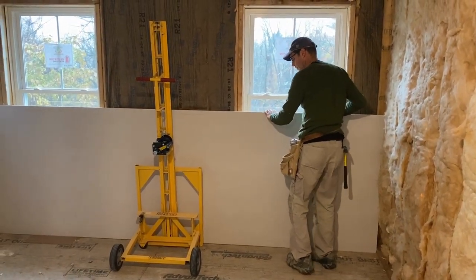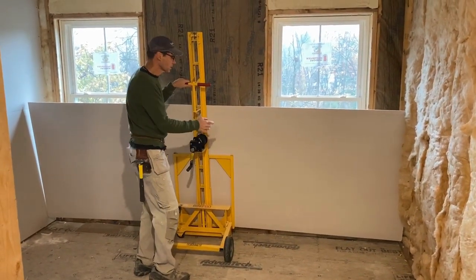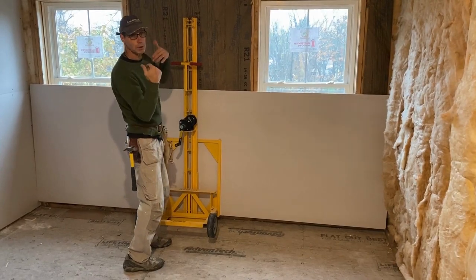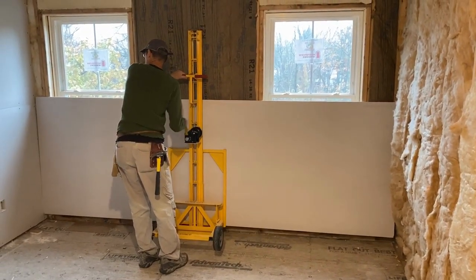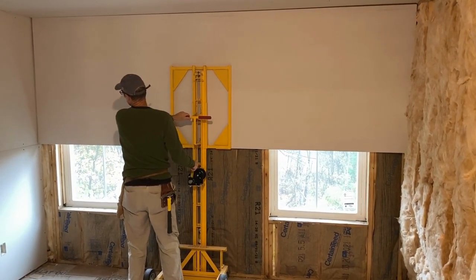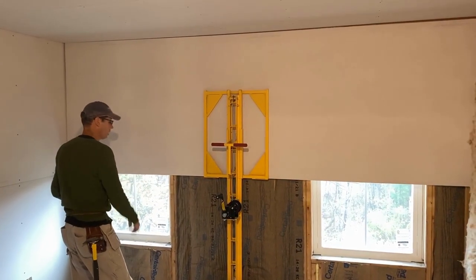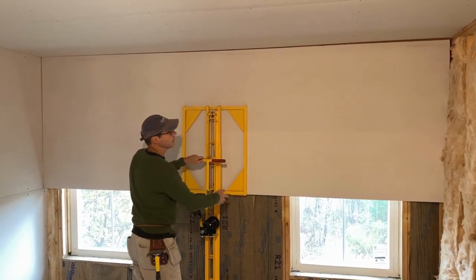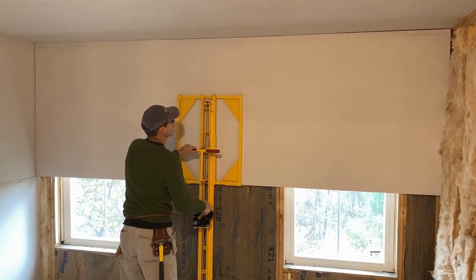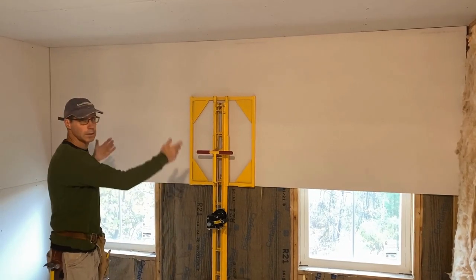I've got the lift right against the drywall on the wall, just lifting it slightly, putting it on the cradle, tipping it back towards the lift. I take it off the ground just a little bit, then put the lift right against the wall — you don't want it tipping backwards because all the weight will be pushing away from the wall. It just glides right up over the insulation. Once I get it close to where I want it, I tighten this corner. Because of the front coaster wheels I'm able to just pull it to the left. There's enough play in the cradle that allows me to attach it to walls that are a little bit out of plumb. Then I fasten the top edge and around the windows — I'm cutting the windows out afterwards.